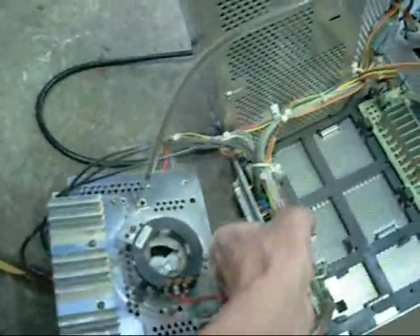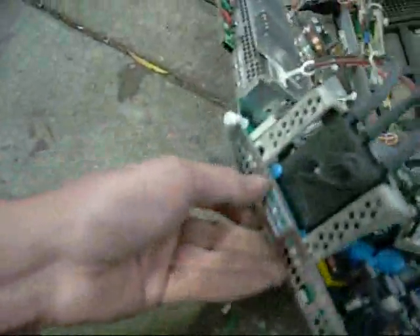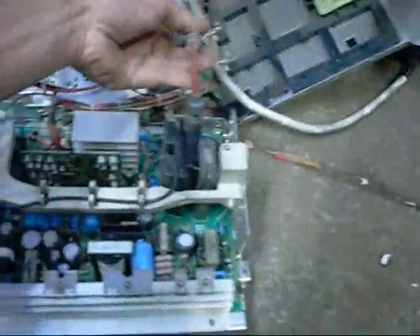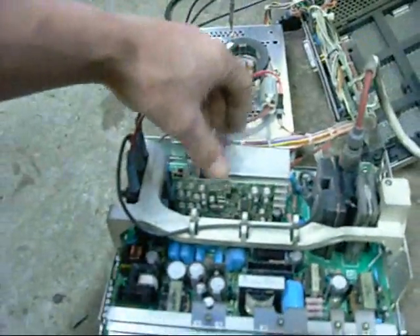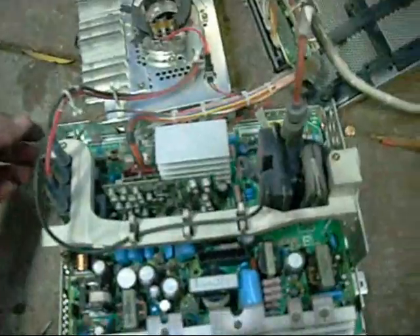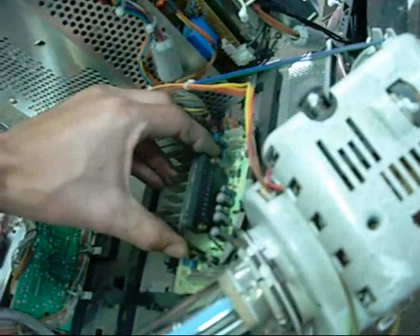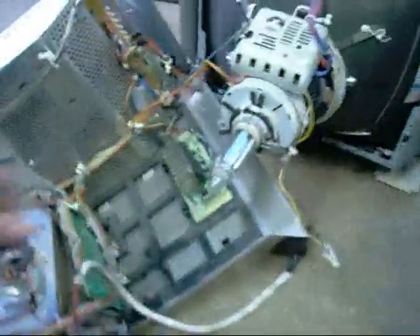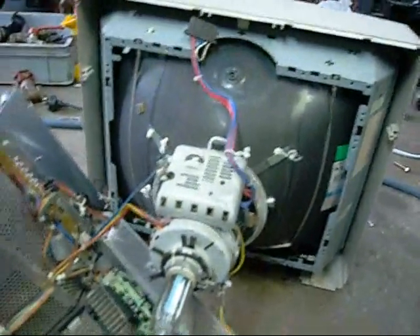It's got a weird looking input socket — I think it's unique to the IRIX Silicon Graphics system. This is the high tension board, with the focus and high tension pots, and the main flyback. That board there has tons of surface mount caps and things on it — a really complicated little unit. That's the main power supply under that shield. That's a big STK pack — an STK 390-120 — I'm sure someone will look that up and tell me what it is. You can clearly see there is only one gun inside that neck, which is what makes a Trinitron tube unique, along with the shadow mask of vertical wires.